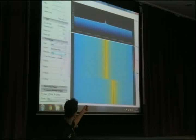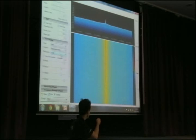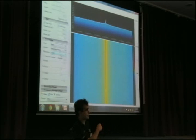Obviously, it's a bit overloaded there, but you can change the contrast and the speed. And you can see that the SSB bandwidth that I was looking at is really invisible in the whole bandwidth that you can see. Obviously, you can notice that there's a large spike in the middle here. This is the DC offset noise. You've probably seen it in the FunCube dongle as well. It's far more pronounced in this, mainly because of the low-quality crystal.